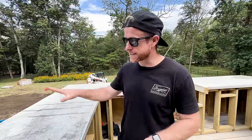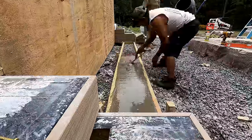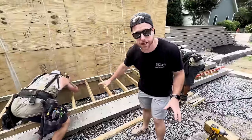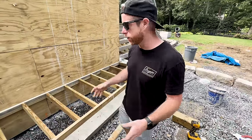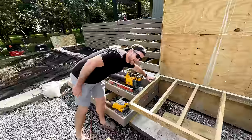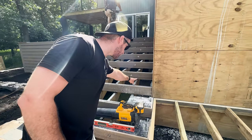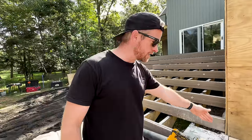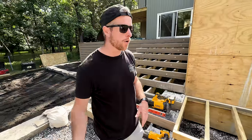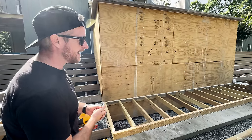We need a mental break from the countertop fiasco, so let's check out the front. The front steps and bench are starting to come together. We've poured a slab down here as just a tiny little footing for the front side of this bench. Our third step is going to be the seat at 18 inches tall — we were between 12 or 18, but this family is pretty tall so we went with 18. At the elevation of the fourth riser we'll have a little armrest where you can put a drink or a plate. It's going to look really thick with everything tying together.